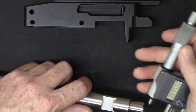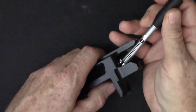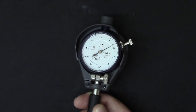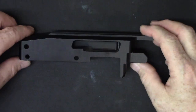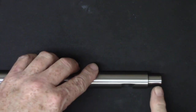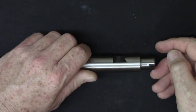There are several ways you can do it, but first you need to know what your numbers are. Here we've got 687 thousandths, 7 to 10 thousandths on our barrel, which is good. We've got our bore gauge — let me stick that in there. I don't know if you can see this, but this is 687 thousandths and three-tenths. We're just two-tenths under. You can take a file and file it as you roll it — that'll help you take the diameter down. You can also put it in a vise and shoe-shine it with 220 wet-or-dry or something like that to work it down.